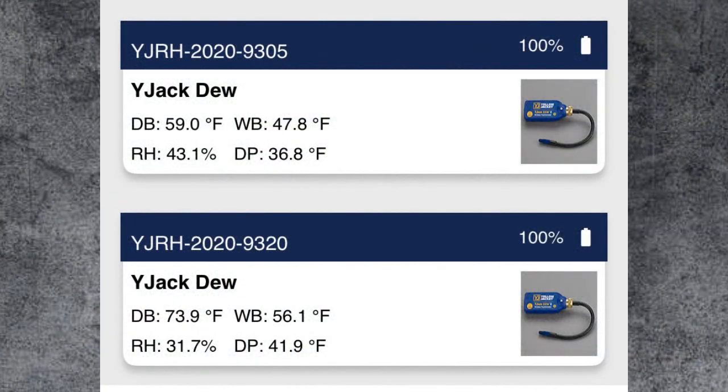Looking at those probes, it's about 14 to 15 delta, and I'd expect between 15 and 20 degrees of delta T — so we're right on the lower cusp. I'm guessing if we give it a few more minutes, it would continue to go up as the probes adjust. After about five minutes in the airstream, it should be pretty well adjusted. Overall it looks pretty good — non-invasive testing, a massive success. The unit looks pretty good. We have a couple of repairs to make: change out the top, change the hood top, and pinch-off and re-braze or recover and braze in a new high pressure switch. I'll take you guys along for the ride when that time comes.